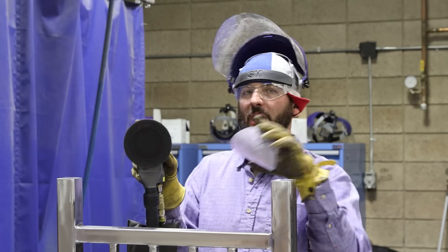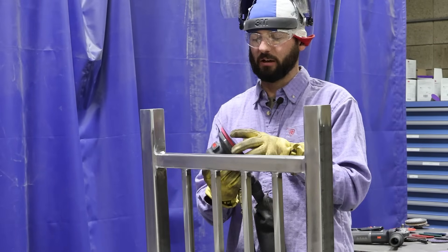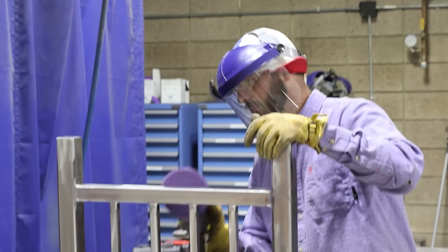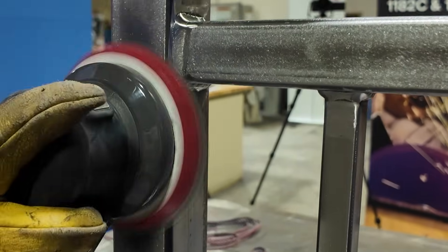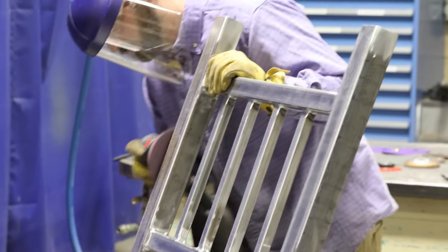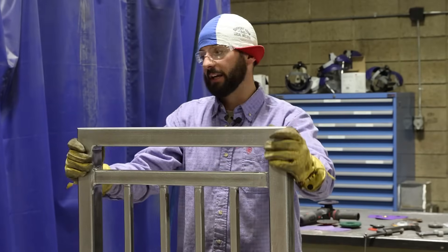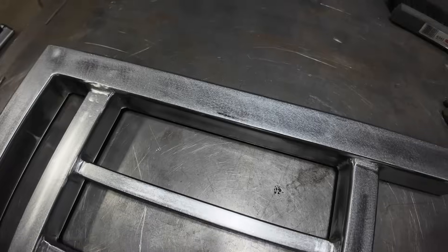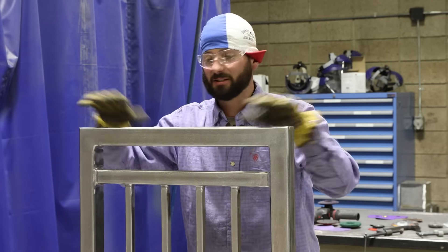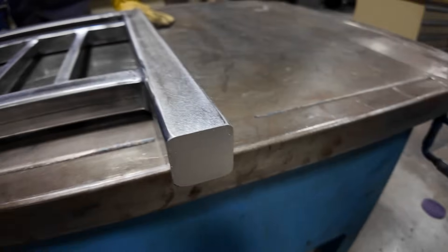You can see when I hit this, that wheel spins in a bunch of different directions. Compared to the grinding disc that always spins a certain direction, we're going to have a different type of finish, and I really love the way an orbital puts a finish on — so that's what we're going to do everywhere without trying to ruin any of those sharp corners. I really do love an orbital sander — it just hides so much. The fact that all the scratches are going different directions, you can really blend in a lot of stuff with it. It doesn't remove a lot of material. We did switch to 60 grit in order to get the finish we got here.